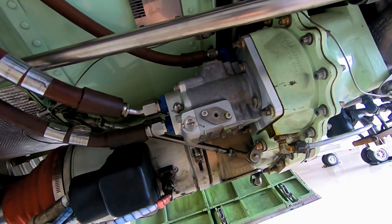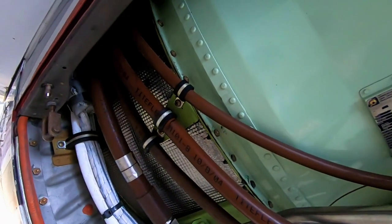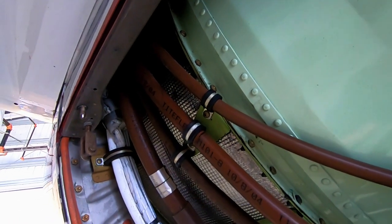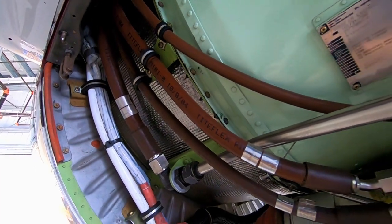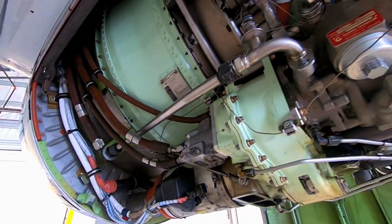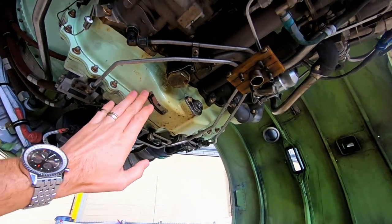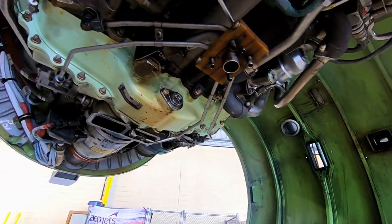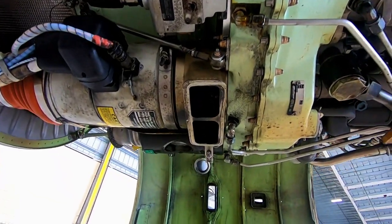This little guy right here would be our hydraulic pump — tiny little thing, doesn't take much. I always thought they were a lot bigger. You've got hydraulic lines running up in there; they go into the hell hole — you guys have seen those from the inside — but that's where it starts. This whole green-colored assembly is the gear drive — that's what actually makes all the magic happen inside there, turning all of those accessories as needed.